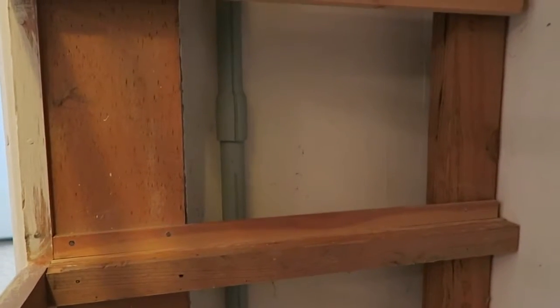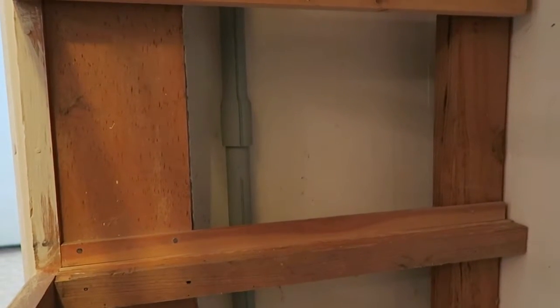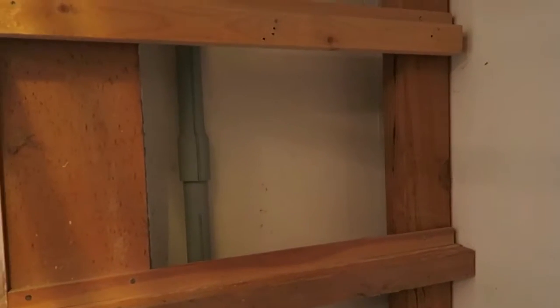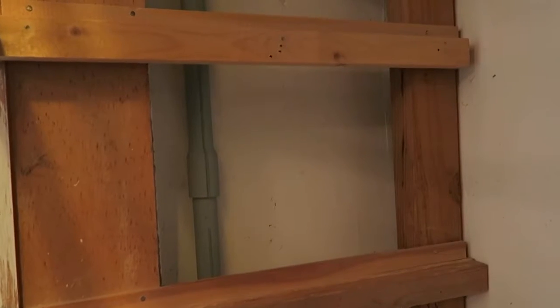But here, back here in the back is the conduit. I drilled out that hole, and I put it down about a half inch, and then I cut a notch in the pipe and cut over at a 45-degree angle approximately. This is a very small spacing in between these drawers, so I ended up doing this in 2 pieces and used the coupler end to join those together.